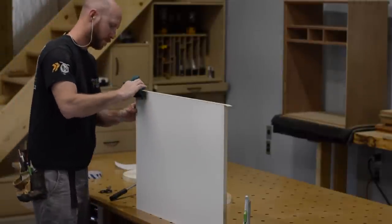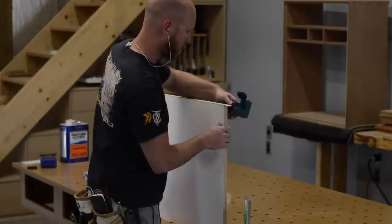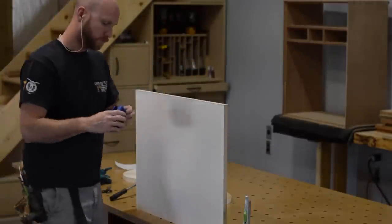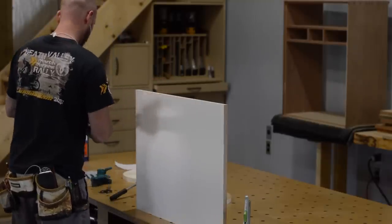You can really get some excellent results. These end trimmers work great — just about perfect results every single time. These side trimmers work really well on PVC or melamine edge banding, but if you're using real wood edge banding, sometimes they can cause a little tear out.